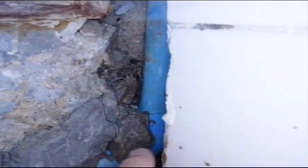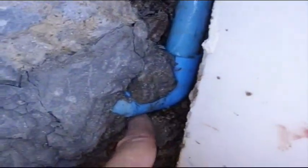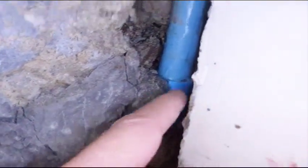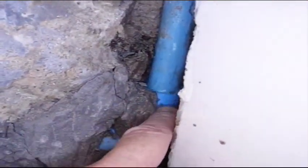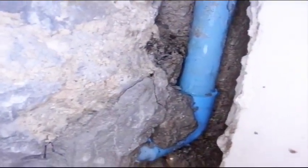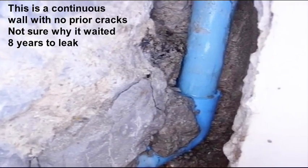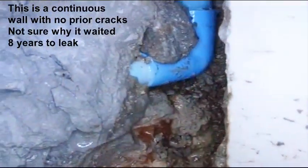Here's the problem — you can see water coming up out of the joint right here. There's no glue in it. There's glue in this joint, in this part of the joint, but they didn't glue this section. They buried it in concrete and kind of hoped it would never leak. I don't know what caused it to leak. I don't think it's a building shift because it's all in the same place. But anyway, there's the source of the leak that was doing all this damage.